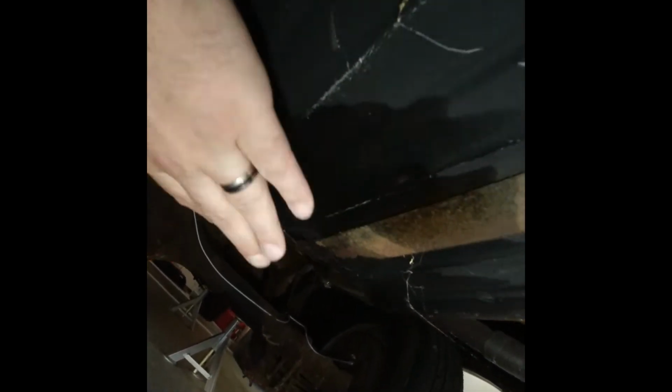I'm going to take out the gas tank and off the rear bumper tonight. I've got to run some new fuel lines and stuff, and I need to know what fuel sending unit to put in this because I'm not quite sure it's a stock gas tank. When I parked the car, it had about 3 or 4 gallons in it. Well, 10 years later, it was completely dry, and I wasn't quite sure what happened.